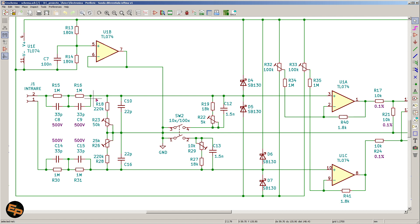If I activate it now, we see that we get a different graph — we actually see a small amplification after a certain frequency, going up to above 1 megahertz, and then it goes down due to the op-amp itself. Now it's better, but it's still not okay — we would like a flat line here. So for that, we need to add another capacitor in parallel with all the parasitic capacitances. I have C5 here, and we need to size it appropriately. For this particular circuit, it happens to be 22 picofarads.